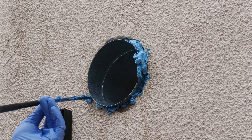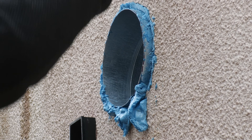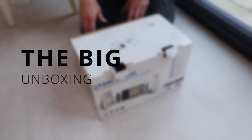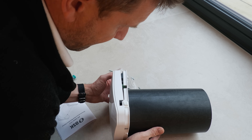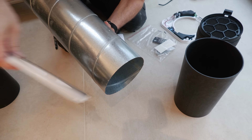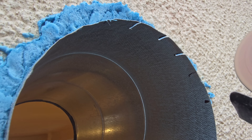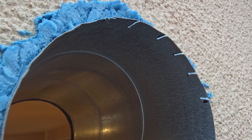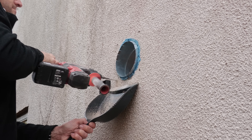Next up the fun bit: securing the pipe with window and door SWS expanding foam. You must get yourself one of these guns if you haven't already, and gun cleaner so you can keep the tip nice and clean after each use — there'll be a link in the description. It's weird stuff, this window and door foam — almost like they've packed it with blue dye — but it cleaned up well with a razor blade once it had gone off. At this point I started unpacking the Zephyr and realised I'd been a bit of an idiot because the fan comes with a telescopic pipe, so I didn't need to buy that 1.5 metre length of spiral duct. The spiral duct I bought doesn't fit the outer wall fixture because the plastic pipe supplied has a reduced diameter at the end, but I wasn't going to remove it. I made a series of cuts in the top half of the spiral duct to marginally reduce the diameter so I could slot the outer wall fixture part onto the duct.